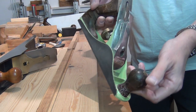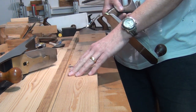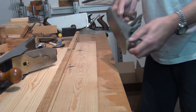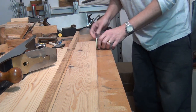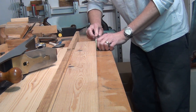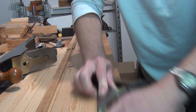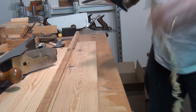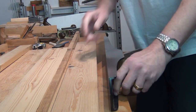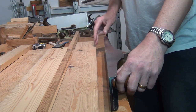I've just shown you that on a number three plane. You can use this with a number eight, which is ideal because it's nice and long and heavy and works really well. A smaller plane will also work as long as it's high enough so the blade is contacting the work. A long plane with a few shavings will quite quickly straighten the edge, which is something you want when you're jointing.